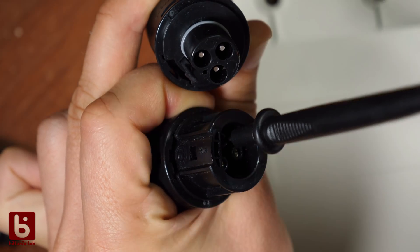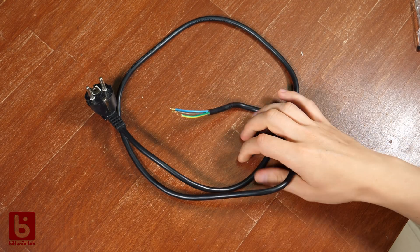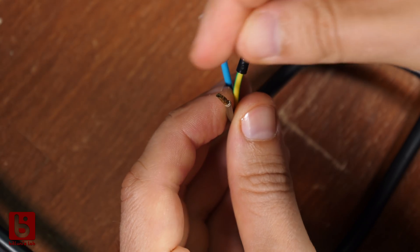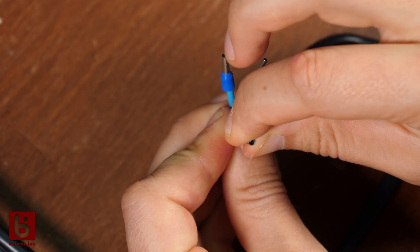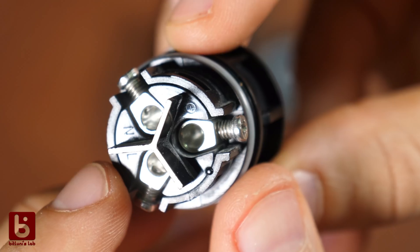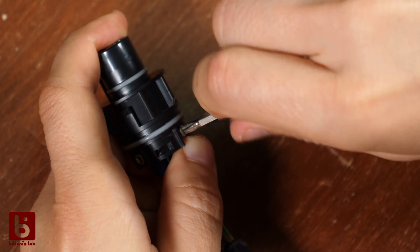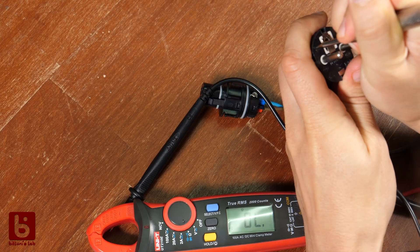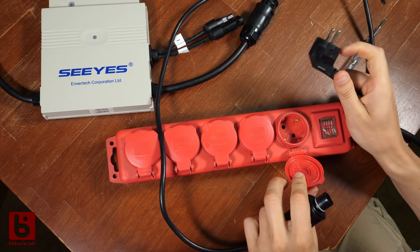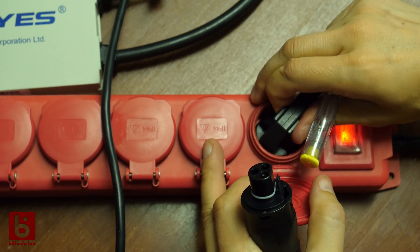It seems it's simply connected through so all microinverters are put in parallel to the AC line. For testing I will use a fitting connector and a simple power cord to plug it to the outlet. Messing with mains power is dangerous so don't try this at home, but I was only electrocuted once this time. It's also not recommended to simply connect it to a power plug since you are potentially bypassing your breaker. However this is just a test to see if a proper installation would be feasible. Conveniently the connector indicates where the live, the neutral and the ground wire should be connected. Using the multimeter I figured out where the live and the neutral should be. European power plugs can be flipped so it's not assured where the live connection ends up — I have to test it before plugging in. This can be done easily using a phase tester.